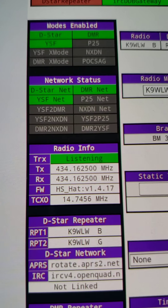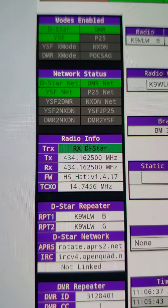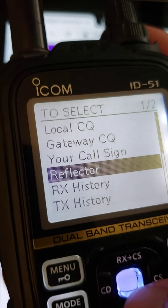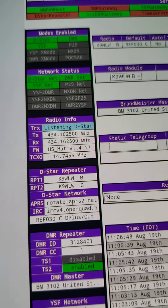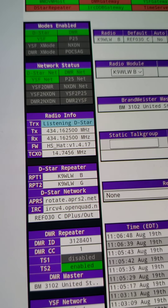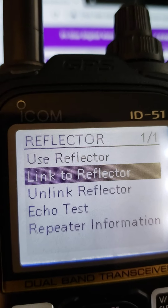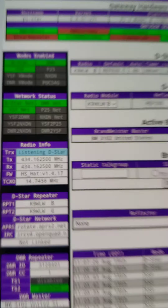With America Link active, radio traffic is now coming through YSF — DMR and D-Star are both on standby. To exit a busy YSF reflector with the FT2D or FT3D, if there's a pause you press and hold the band button. It sends a quick transmission to the hotspot and you hear 'not connected,' confirming you've unlinked from the YSF reflector. Then you wait the 20-second hang time for it to return to full scan mode.